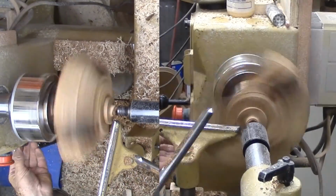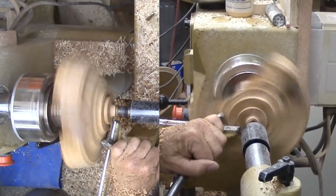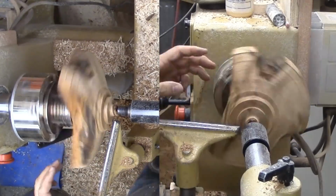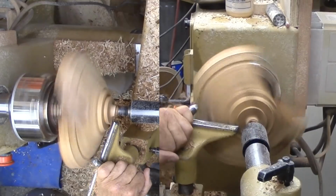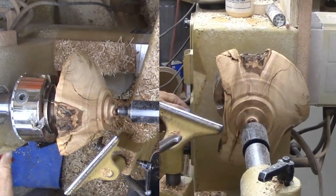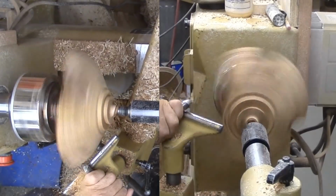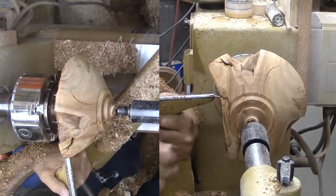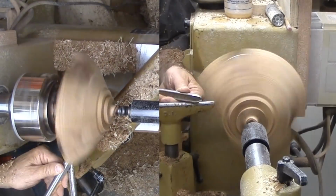A brief trip to the other side to bring more balance. However, with that big chunk of wood gone, there will never be any balance. And there will never be a chance to ride the bevel. This apricot bowl is 1/3 air now. Finally, I get it close to a curve and cut a tenon. Whew! It is still hanging in there.